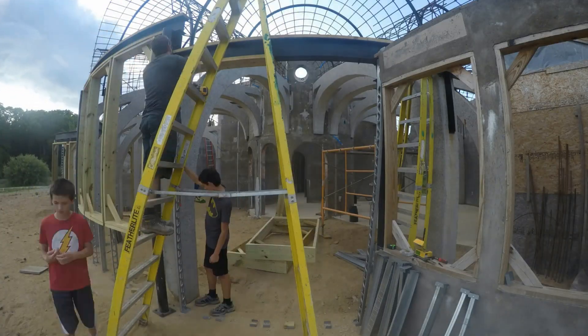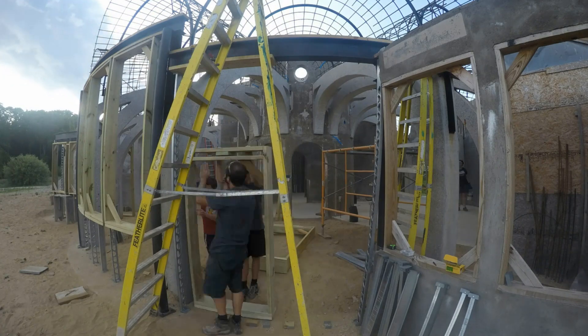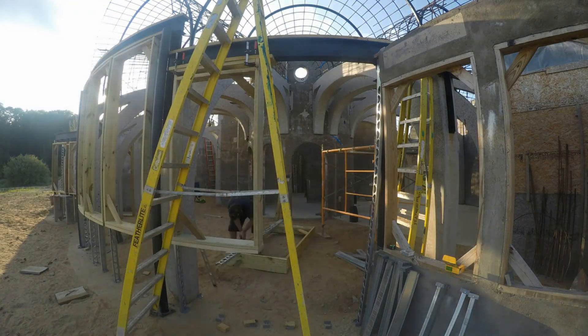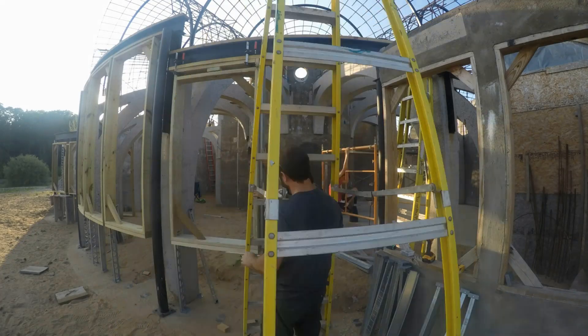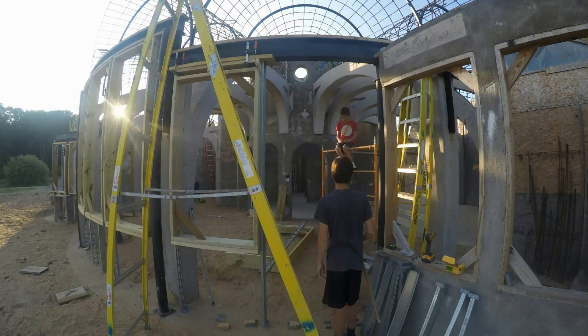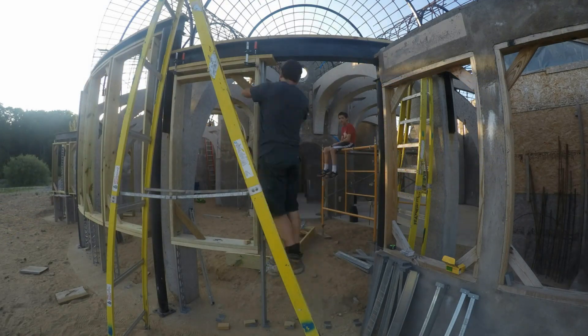Here it is again from the southeast side. You can see the clamps from the outside. After it all goes together the assembly is actually very rigid. Steel studs are much stronger than 2x4s and they're positioned between steel and concrete. The screws I am using are also much stronger than nails and the window bucks are treated 2x8s.